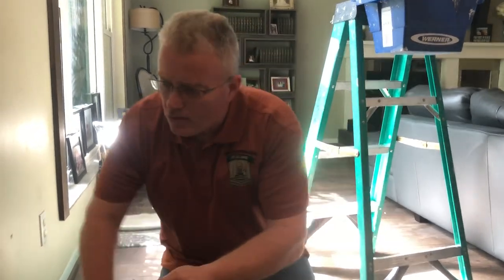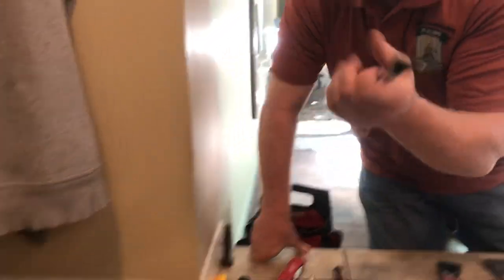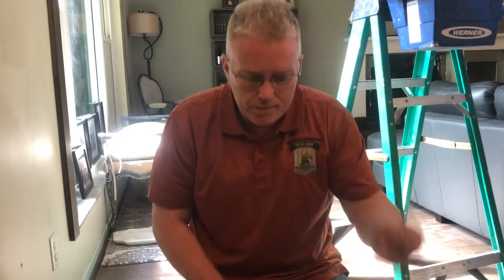When you're hanging natural fabric you get frayed edges — go right up to it with this tool. It takes off the little strings and also little pills or balls on grass cloth that you don't like the look of. You want to use it so it becomes a little dull first — if you use a brand new blade on grass cloth you'll be replacing it constantly, so it's got to be slightly used.